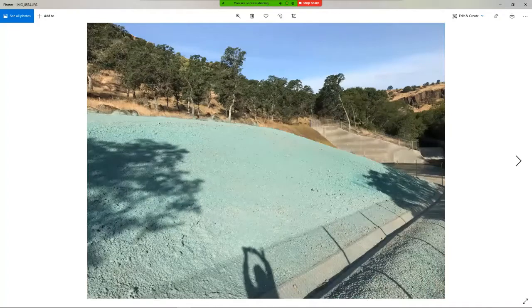When we just use hydraulic mulch, it would be a temporary BMP. You cannot get a notice of termination accepted with a photo that looks like this — they'll reject it. Even this beautiful application would not get you a NOT yet because the water board would consider this a temporary stabilization method. What they want to see is permanent — even if this contains seed, which it did in this picture, it obviously hadn't started germinating yet.